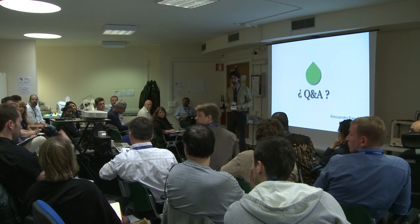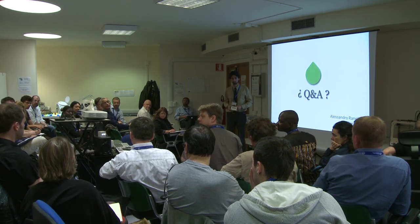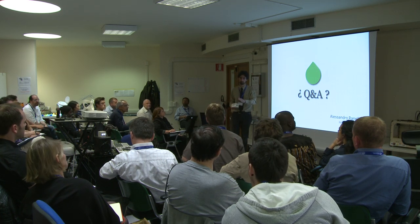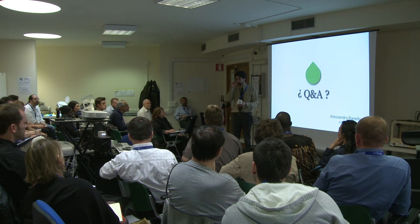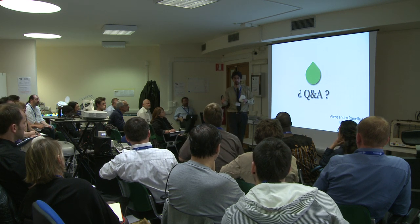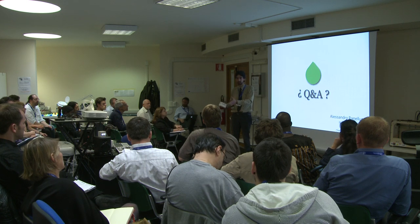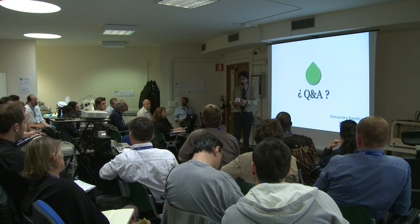Any question? You mentioned these heated beds. The only reason why you need them is basically temperature homogeneity? No, actually, they are not necessary in all situations. You can get rid of them. Also, they use like 80% of the power of a printer. So you can basically cut your power needs down from 400 watts to 90 watts. So if you can get rid of a heated bed, it's best for you. But it's very useful for fighting warping problems.